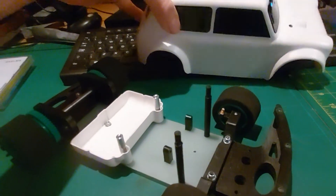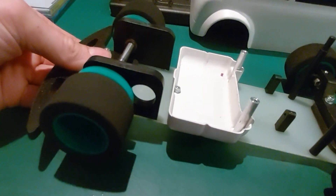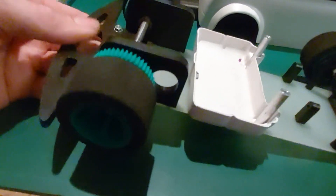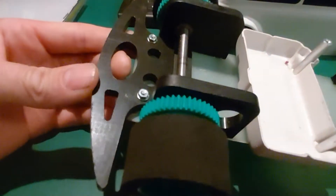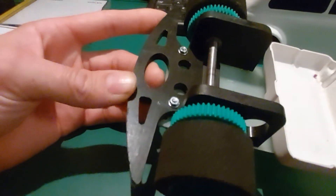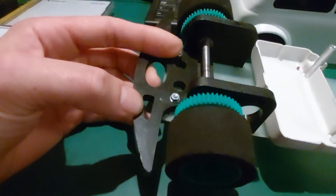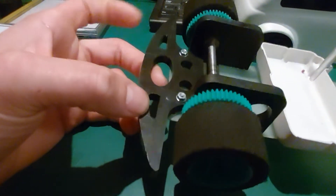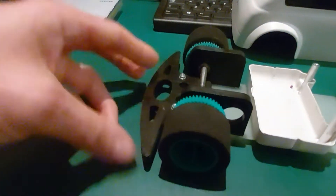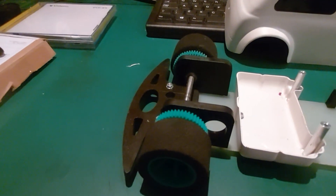This is straightforward — it's just a piece of quarter inch silver steel for the rear axle. You could use mild steel or stainless steel. The acetal bumper has just been cut out on a router. What I'm going to experiment with is some recycled high-density polyethylene — screwing through the mounting holes and then using a pattern bearing guided router bit to route those out, as a quick way of reproducing the parts. I think you could do the same for the motor supports for the rear axle.